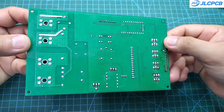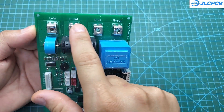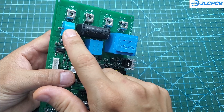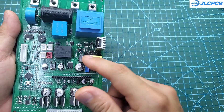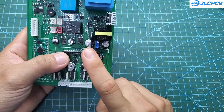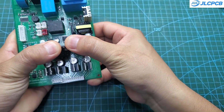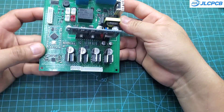Here is the complete circuit after soldering all the components. At the top we have four terminals for connecting to the transformer and the load output. Additionally, we have a CT current sensor, AC filter capacitors, and a voltage feedback transformer for regulation. This controller uses the EGS002 to generate the sine wave signal. You should buy the genuine EGS002 from EG Micro to ensure quality, as there are many low-quality EGS002 modules on the market that won't be reliable for long-term use.